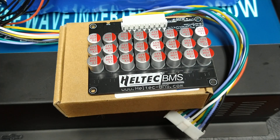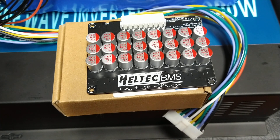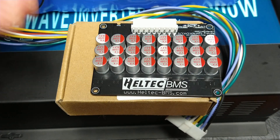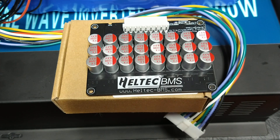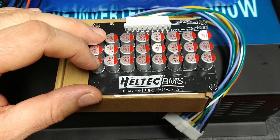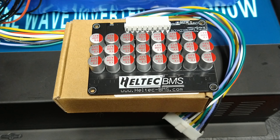What I've noticed is it'll pretty much keep the pack under about 10 millivolts of balance. The other thing is that whenever you're charging with high current, having this connected keeps the cells way more balanced than they would be otherwise. It happens in real time — it's not storing power and transferring it later; it all pretty much happens in real time.